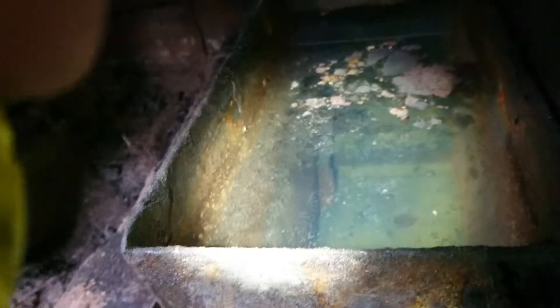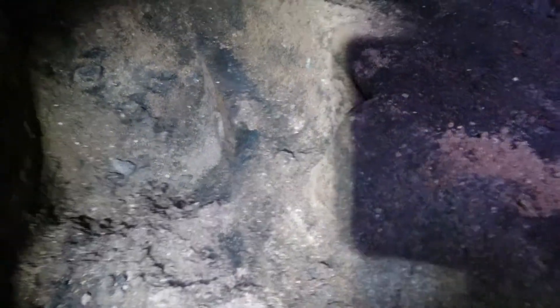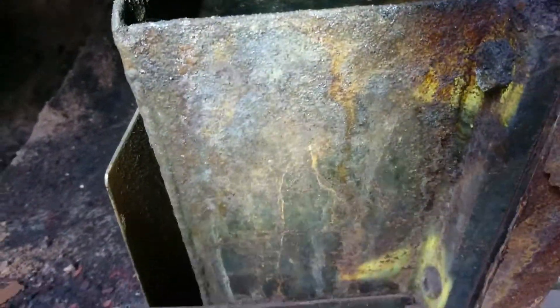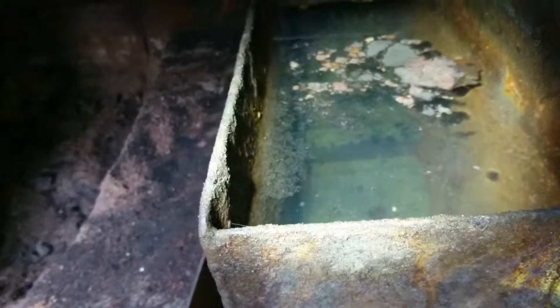This is the water-cooled tank. This is the air pipe from the three-way air valve, and that just runs into a big piece of channel — you can see there — to a snout sticking through. The front of it is made of eight millimeter plate, or three-eighths for you Americans, and the tank itself is probably only about a sixteenth of an inch plate. So if you're kicking its head in all day, this will overheat the tank. It's a big powerful forge.